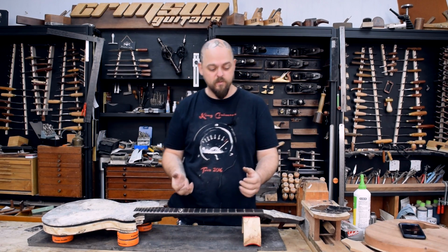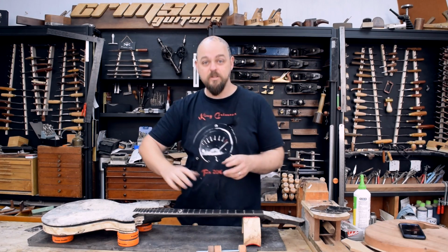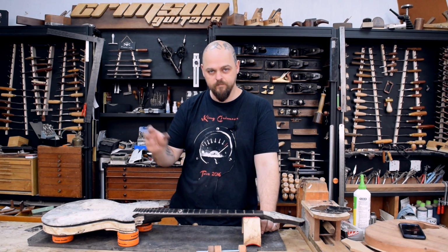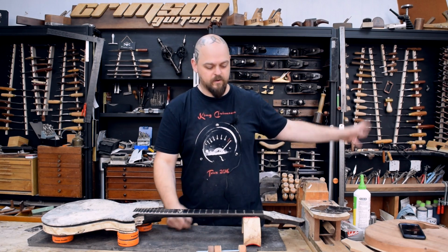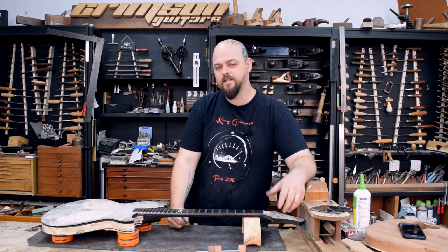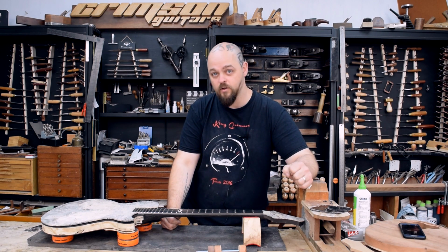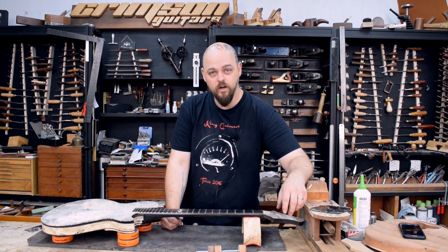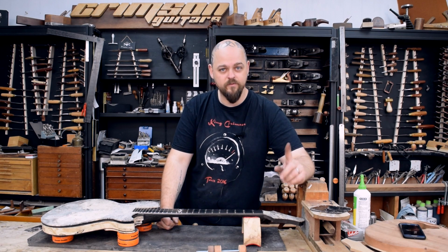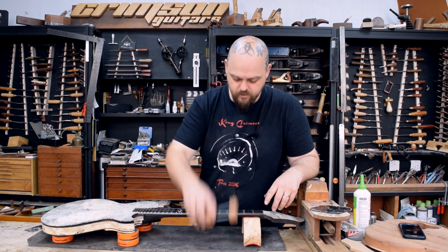This is a Mini-torial, I suppose, maybe, and kind of a little bit of an advert for our fantastic spool clamps, which are surprisingly useful. I went for a decade without actually owning any. I'd been violin building, apprenticeship and all that stuff, used them all the time, and then came to guitars and ended up, I don't know why, but I thought that you needed a hell of a lot of clamping pressure to glue a top on, and it just is not so. In fact, if you clamp down too hard, you can starve the joint of glue. You can squeeze too much of the glue out, and it hasn't happened to me, but I know people to whom it has happened. And anyway, we developed the spool clamps at Crimson Guitars, and now I love them and use them a lot.